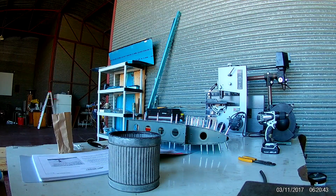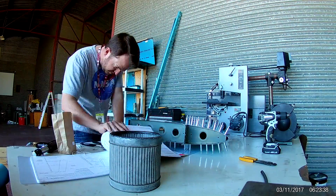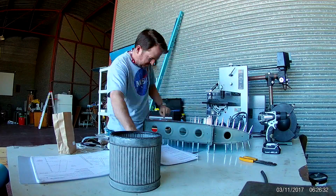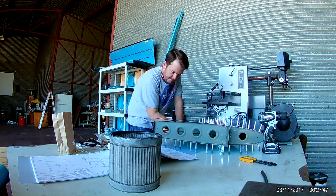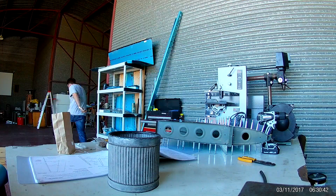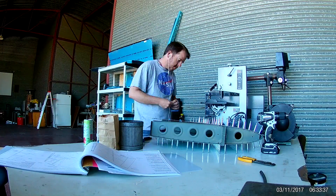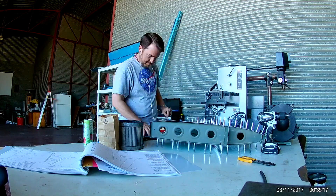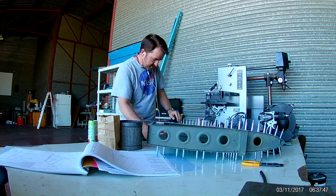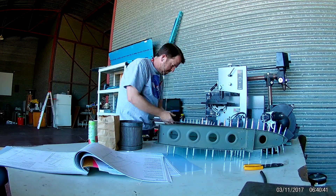On to the actual riveting — this is the next day. This requires riveting by hand with a rivet gun and bucking bar. I have a 3X rivet gun and normally run the power at about 50 pounds for these smaller rivets. I have a tungsten bucking bar — it's not actually a proper bucking bar, it's a piece of tungsten I bought off eBay. It's a counterweight from some kind of control surface on a military aircraft, 5 pounds. It's wonderful but a little heavy — I'm thinking about cutting it in half to make two 2.5-pounders.